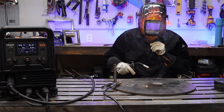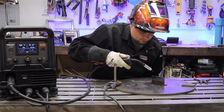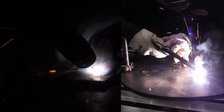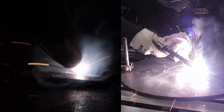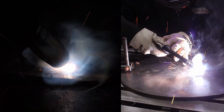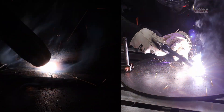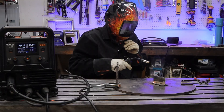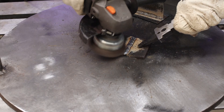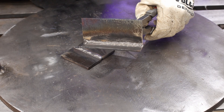That first test of a flat horizontal weld on three-sixteenths inch plate turned out nice, so I kicked it down a notch and did a fillet weld on some welding coupons. I'm using 0.035 Vulcan flux core wire. If you want to get really nitpicky, these are eighth-inch coupons and technically an eighth inch is about 11 gauge, and the Omni Pro settings go from 12 to 10 gauge — so go a little slower if you choose 12 and quicker if 10. Both those welds turned out just fine with the flux core.